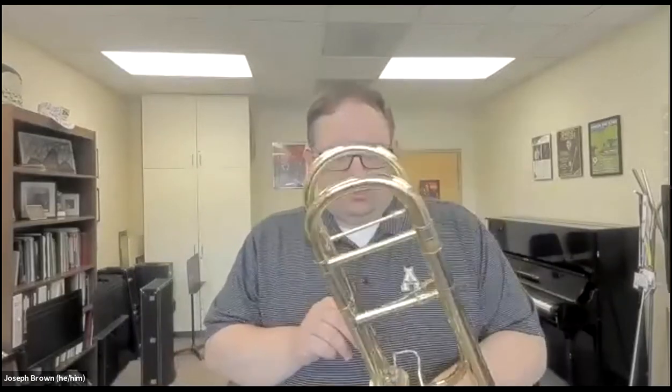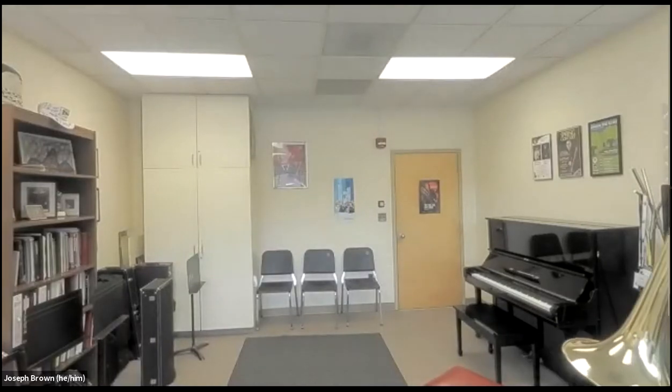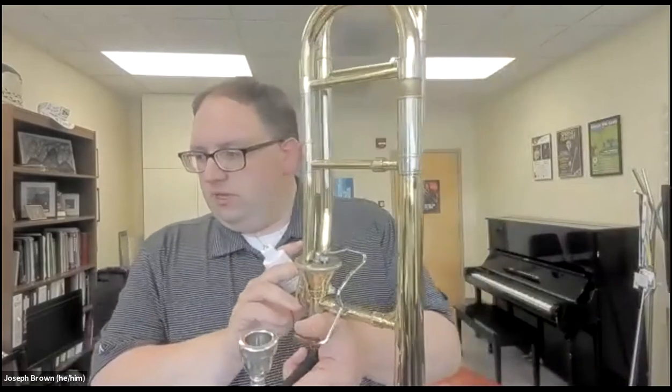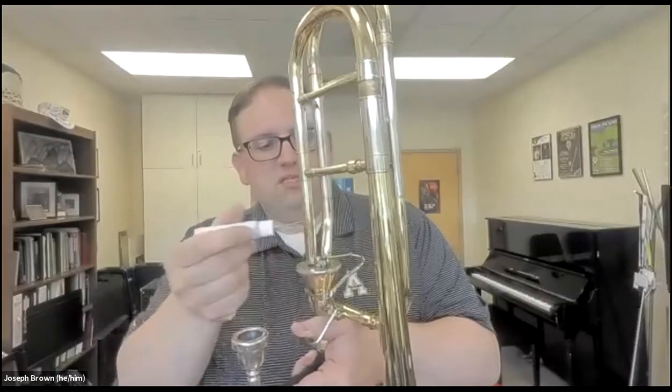And it's a good time to also, if you have a thicker oil like a Hetman spindle oil, let me grab mine right here. Not a spindle oil, but a linkage oil. This is what I use, this Hetman linkage. And you can take a little bit of oil and make sure all the moving joints, like this little ball joint I have right here, where it's hard for you to see it, where this bar comes up and meets this other bar.